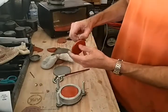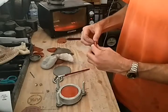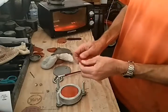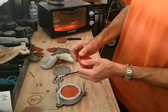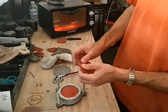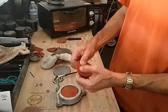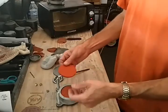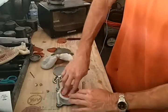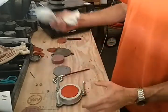Last thing: we take this last piece of mold rubber, take the paper off, and stretch it out on the ends. I get these in big sheets and I have a die that I created so I can punch these out — they punch out at one size and then I can squish them up to the size I need. That fits right over that; you want to keep it within the mold frame. Once you do that, then more talc.